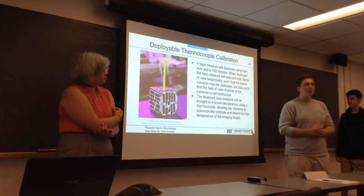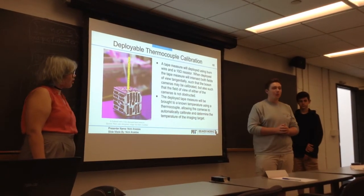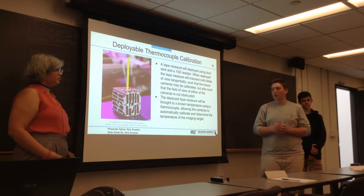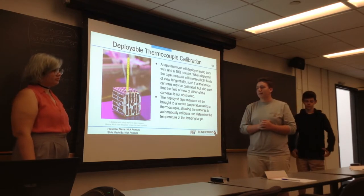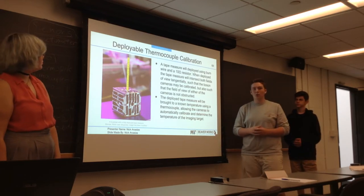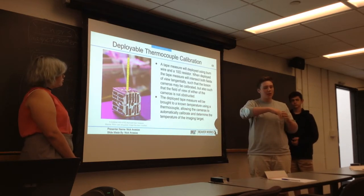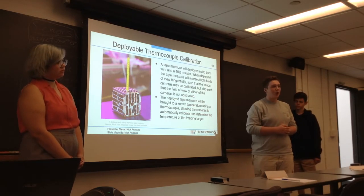As Isabelle mentioned, the FLIR does two-step calibration, and this is our second step. We're going to use a tape measure deployable equipped with a heater and a thermocouple, so that we have a body of known temperature besides the shutter. It will intersect both 16-degree fields of view very minimally, taking up a couple of pixels on our array to calibrate it. It will be folded for launch, and then there will be a fishing line or some sort of burnt wire melted by a 10-ohm resistor to deploy it.